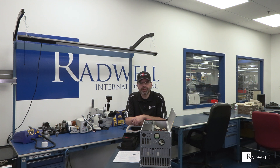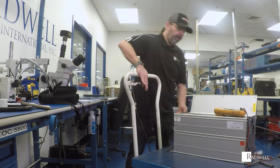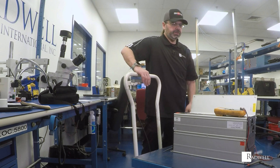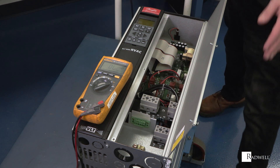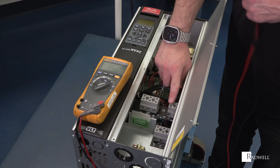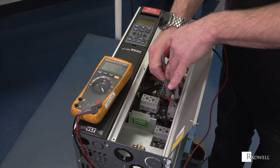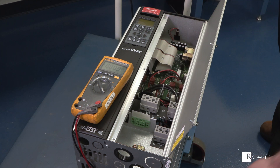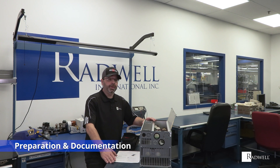One additional thing: make sure your bus supply is completely dead before moving forward. Inside the drive there are bus capacitors that store voltage, and we've seen instances where the bus supply can remain energized for a very long period of time. The terminals labeled DC+ and DC−, sometimes labeled 'bus,' need to be checked. Put your voltmeter on DC and verify those terminals are 100% at zero volts before proceeding — it can be deadly.